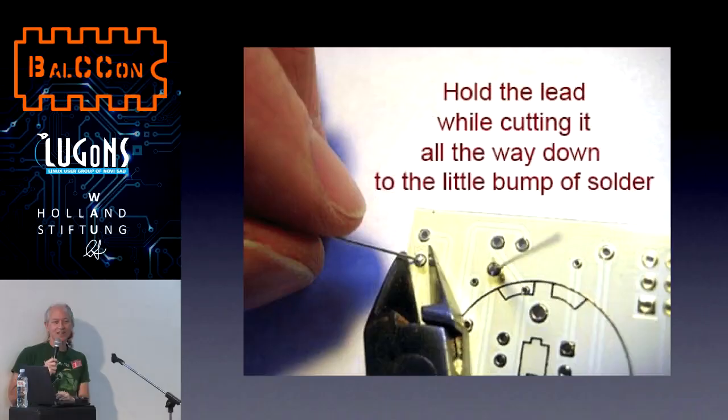And then we have to cut the leads short. Because if you don't cut the leads short, these leads will bend over and make connections you don't want. Okay? So, there's too much. I'll show you that.